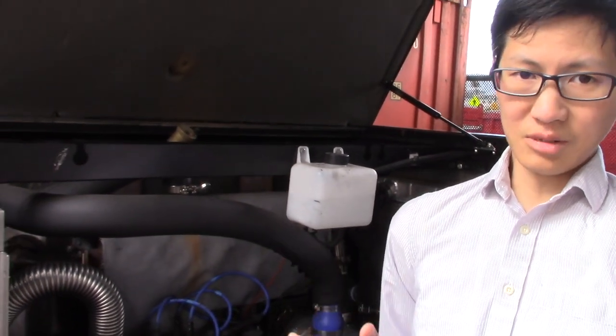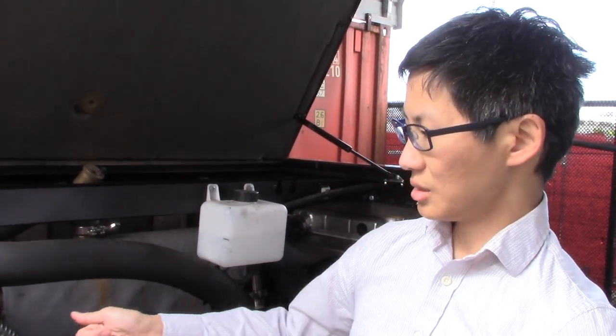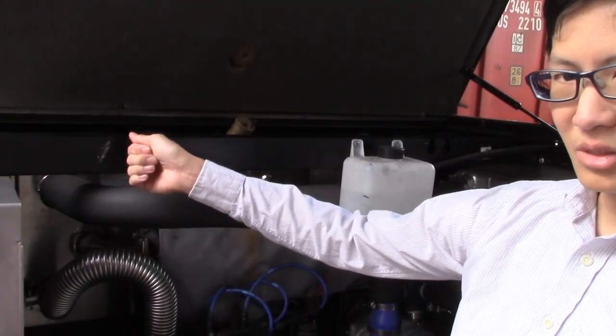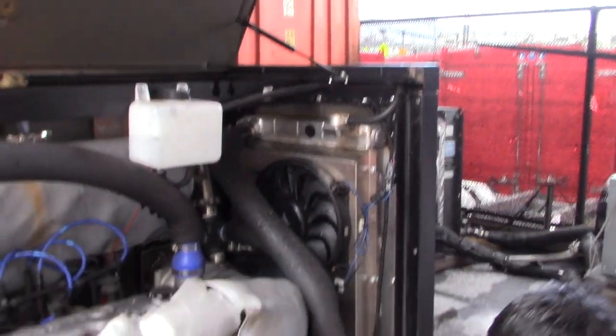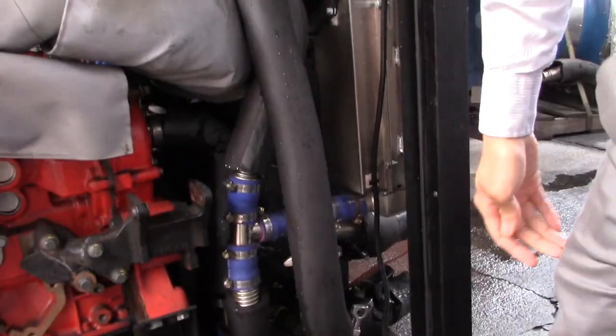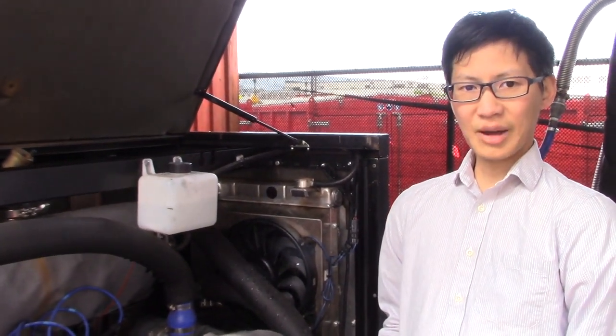After the exhaust is done carrying out pyrolysis, there's still a tremendous amount of heat remaining — still hundreds of degrees centigrade. The coolant, after it's gone through cooling the hot gas, then comes over here and cools the exhaust. There's another vessel down here that is the heat exchanger for heating the external water circuit — the CHP function. By this means the Power Pallet is able to provide two kilowatts thermal in the form of hot water for every one kilowatt of electrical load. The thermal output is tied to the electrical load because it's based on waste heat, but as long as you're generating electricity, there's sufficient heat to power the CHP system.